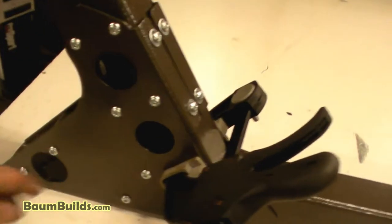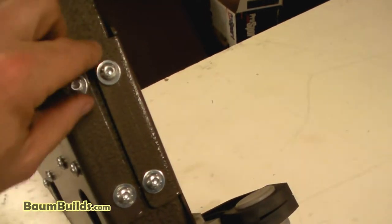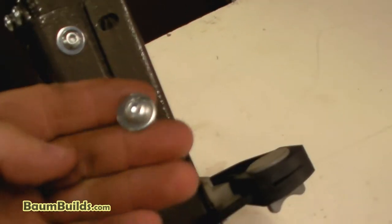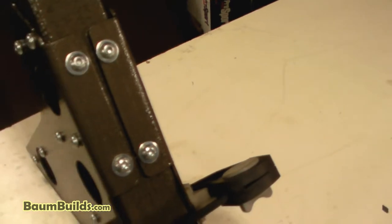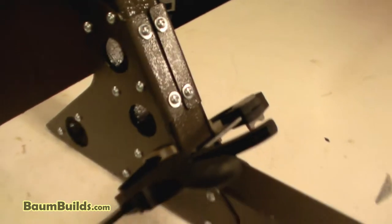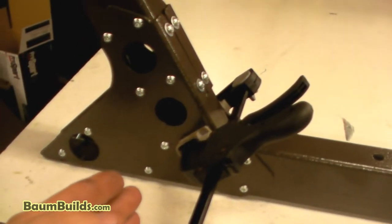We've populated all the holes with the 7/8-inch long hardware. A general note here: these holes are slotted. Any hole that's slotted, you should put a washer on there — that's a general rule of thumb. You should use washers where they're called for on the drawing wherever possible. Now if you run into a situation where it's too tight and you can't get one in there, that's fine, but when you can, use the washers. None of this hardware is tight right now — it's just bolts through the holes — and this guarantees that later on I'll be able to get all the bolts in the holes.